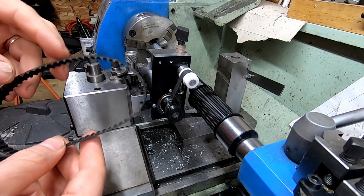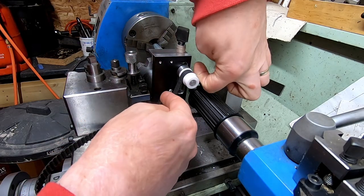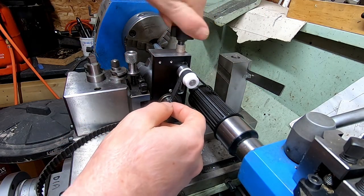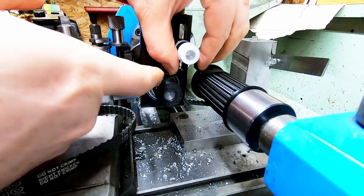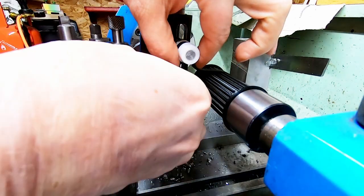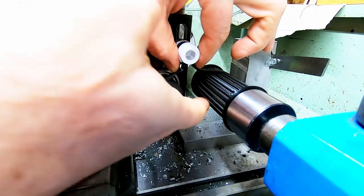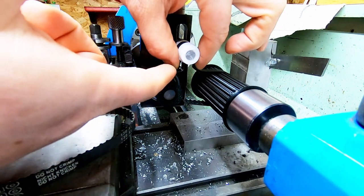So my thought was either to have two extra rollers sort of either side there, so that would involve letting this one down a bit and then having a roller either side to sort of pinch the belt in to get a bit more wrap around each of the pulleys, and hopefully a bit more tension, because you'd have more springs working for you.